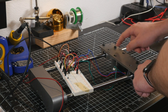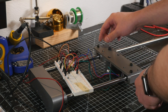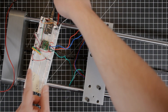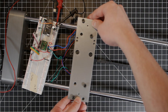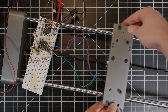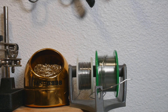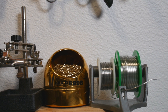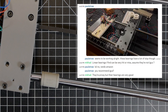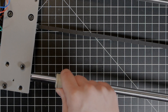I'm actually not going to fix that by changing the hole size — I'm going to leave those as M3, because these blocks from Amazon are just really sloppy. They move back and forth a ton, and they're also quite noisy. It sounds pretty grindy with a lot of back and forth slop, which means the plate shakes as it gets pulled along and the video is basically unusable. Thankfully, a friend suggested igus bearings, so I ordered some and it's a different world — they slide silently and have basically no play on the rod.